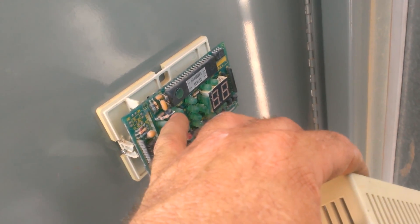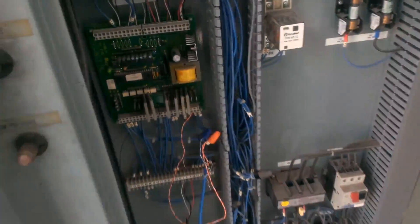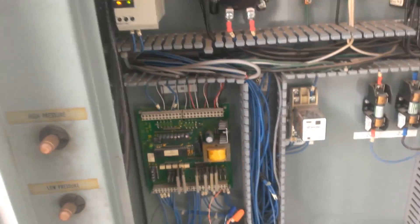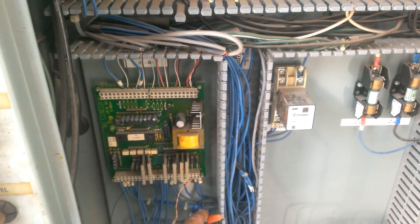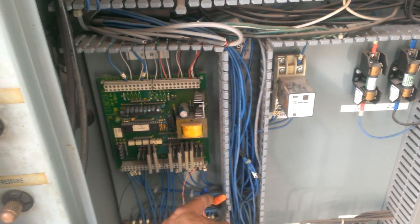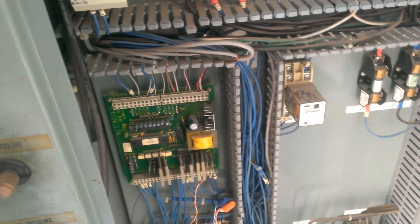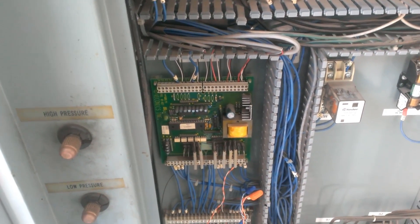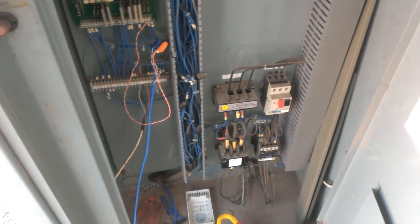I've got my five volts going to this and I'm just getting no lights, no action, nothing. So I'm pretty sure this thing went bad. The controller here has a heartbeat, even though it's real slow. I'm probably going to call the company and check on ordering that part. But right now I've got a blower and an air conditioning solenoid — which I think just opens up to dump the water into the closed loop — activated to 24 volts, going through this CAT5 cable, just using it for thermostat wire, over to a thermostat I dropped in the return duct. That's going to cycle the compressor, so it's just going to cycle in air conditioning mode. It's going to run a lot because it's hot, so it's going to dehumidify also. That should keep this sucker running over the next day or week, or whatever it's going to take for me to get that part.